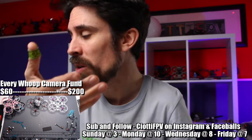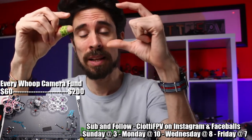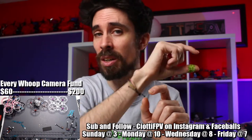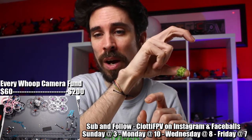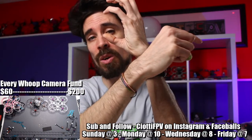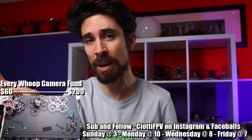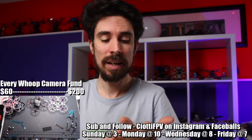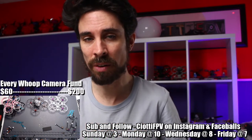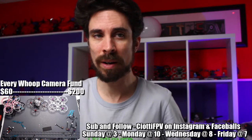The motor plug, I don't know if it's actually the male or female end, but let's just call the motor plug on Tiny Whoop motors the male end. You can buy the female ends of that plug with wires coming out of them. I've yet to find them with silicone coated wires coming out of them. I've only found them with PVC coated wires, which sucks. But if we can find those female plugs with silicone wires, we can just cut that really short and then solder those to the direct solder pads on the AIO. And then we've got our plugs back. You only have to do that pain in the ass 30 gauge soldering one time. So first person to find those plugs with silicone wires wins.